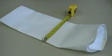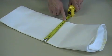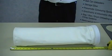There are several dimensions we'll need in order to provide a quotation. You might have this information in your OEM manual or on your drawings, but if not, one of the dimensions we need is the diameter of the bag. A simple way to determine this is to lay your bag completely flat, put a tape measure across it and measure the flat width. In this sample, you can see that this measures nine and a quarter inches, which equates to a five and seven eighths inch diameter filter bag.